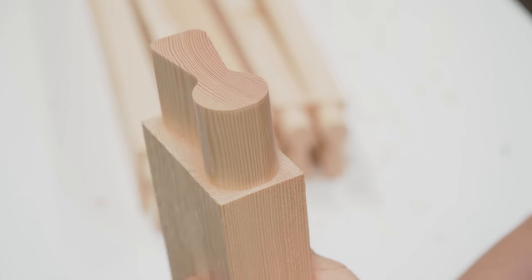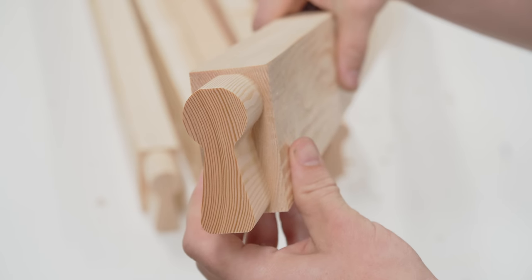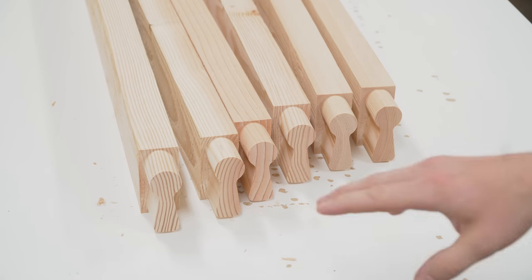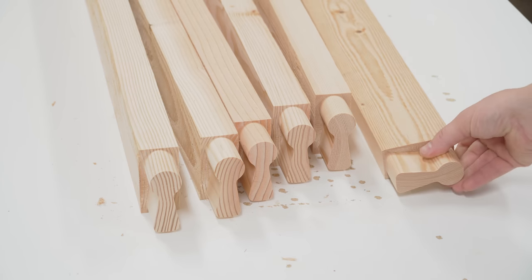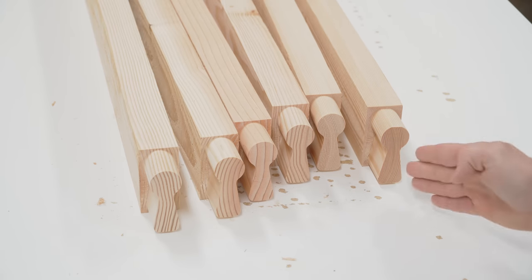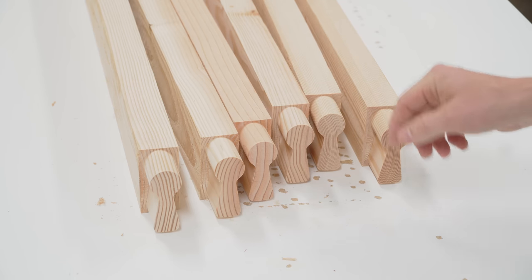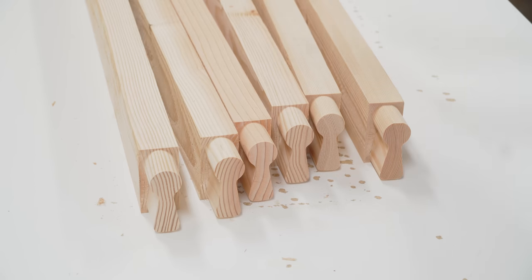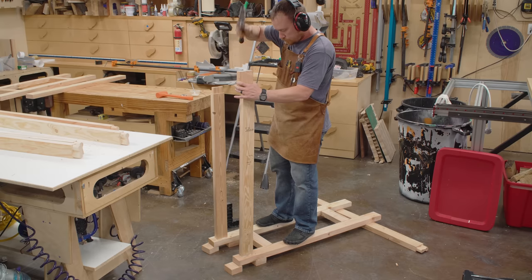These tenons turned out great. Look at the grain orientation on this 2x4 — you don't see that often. This board was actually clear of any defects whatsoever. One thing I made sure of before cutting anything was to sort all of these pieces so that in their flat orientation all the boards are flat-sawn — meaning when used in their final orientation they'll be quarter-sawn and therefore resist sagging the most. These will be strongest with the force applied in that direction. On this project it probably doesn't make much difference, but it's worth taking the extra 10 seconds to pick out the correct boards.